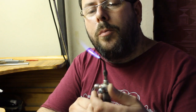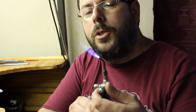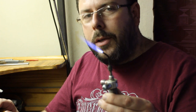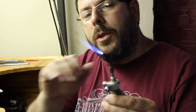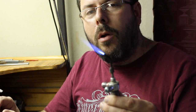A better flame to use would be your neutral flame. You just add a bit of oxygen until the feather is just gone. Now your oxygen and your gas is in balance — perfect harmony. This is the best flame for general purpose soldering on gold and silver.